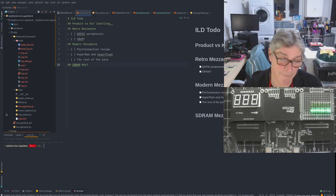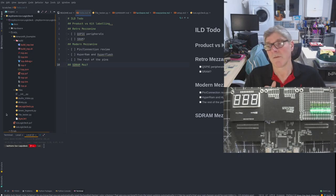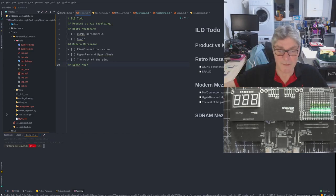The SRAM will be similar. It's got a 16-bit data interface, 10 nanoseconds access time, which means 100 million words per second. The word length is two bytes, so it's 200 megabytes per second. So it's similar in terms of transfer rate, but it's consistent. There are no pauses for the DRAM internal refreshes and all the complex state machine that goes with that.